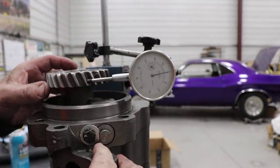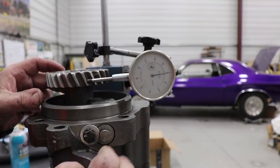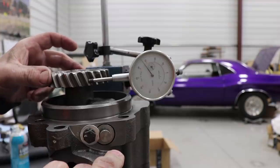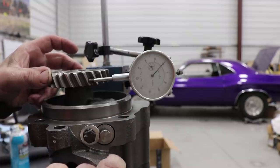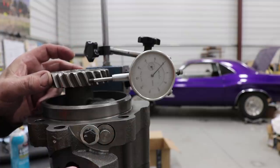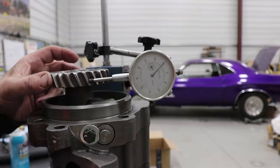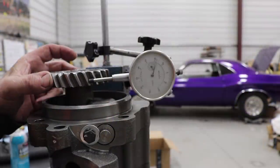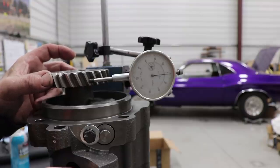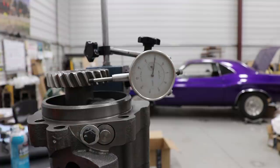So I'm going to stick a pen in here and jam it in the gear so it can't move, and then we're going to turn this one. We're not moving the idler gear — this is strictly the driven gear. I'm having a hard time putting enough pressure on this to hold it still, but let me push harder. Okay, there's our backlash. What do you see? Looks like about 20, 21, 22 thousandths. So that's acceptable — it's in the middle of that range. You get 35, you're toast.